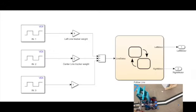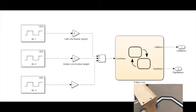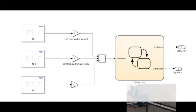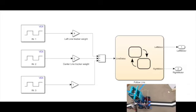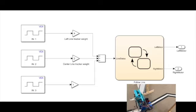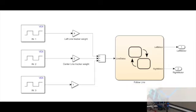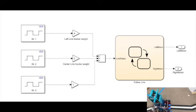In order to achieve our autonomous function, we took 3 IR transmitter-receiver pairs and utilized the autonomous line-following function from the example provided in the VEX companion app, modifying it to follow a white line instead of a black one. This required rethinking through and editing the provided logic matrix to better interpret the 3 inputs from the trio of sensors that we use.